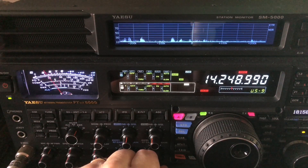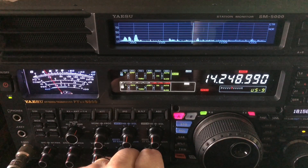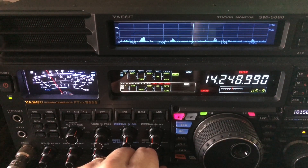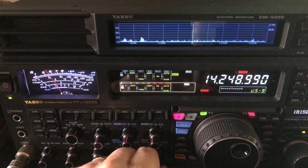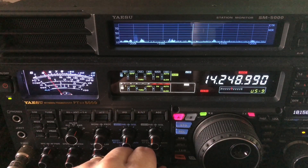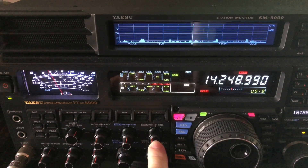What's happening is it's building up and discharging. Know that about power line noise. Let me turn the noise blanker off - so there it is. That's not nearly as bad as it's been, but they're going to take care of it. Use the noise blanker only at the level that you actually need to knock the noise down, and realize that not every bit of noise can be knocked down.